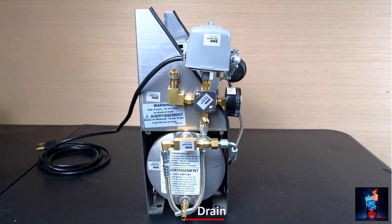We have a drain — this is where we can drain any water out of the tank. When we're pressurizing air, that moisture can collect inside the accumulator tank. So it's a requirement that once a week we need to open the drain to drain out any water. In humid climates, you may have to do this more than weekly. Eventually, if the tank fills completely with water, you cannot store any pressurized air in the tank.